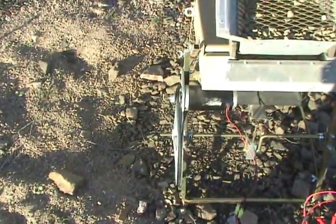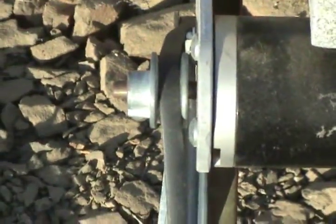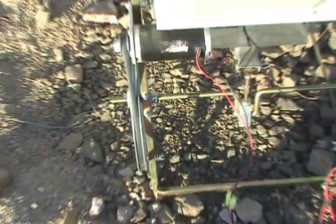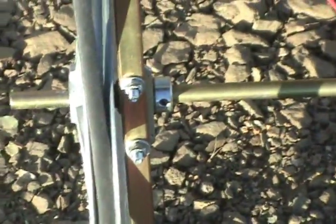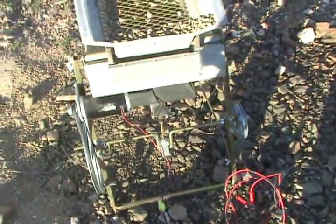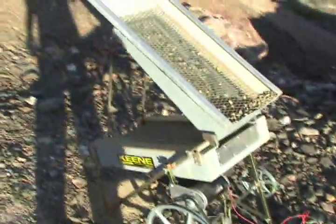You can probably see that the drive belt is over to the left, but the big pulley is over to the right. So the bearings have shifted — the set screws are perhaps loose. All in all, I am not completely happy with the dry washer technique.